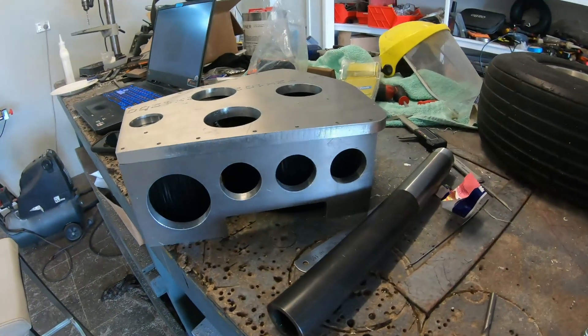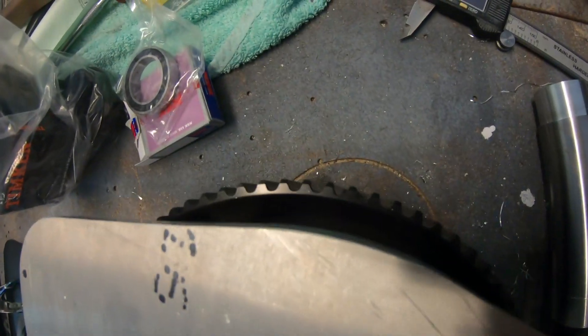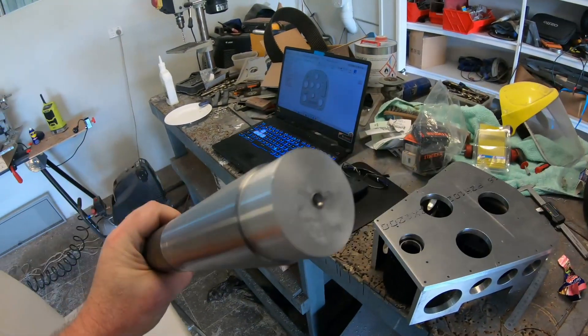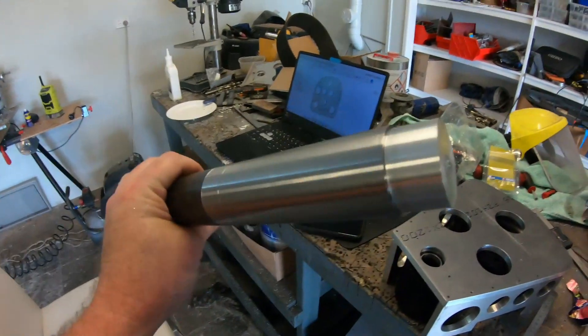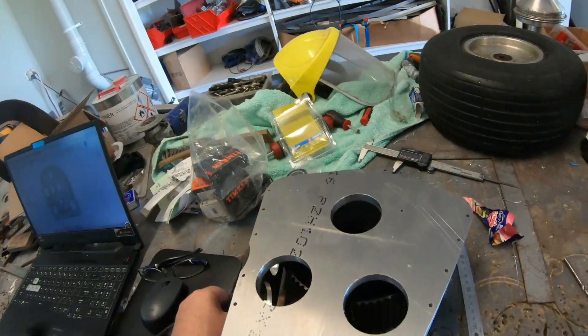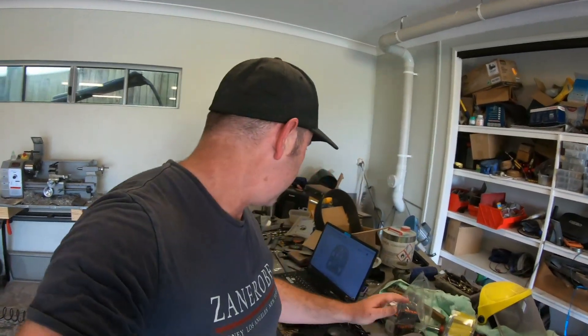It's coming together. You can see I've got the gear pulley sitting in there too — they're not quite lined up, but I've got the shaft working on it at the moment. This is a chrome moly tube — a hollow shaft so you can run an in-flight adjustable prop through it. Pretty straightforward. Nothing really flash about it; we're just machining, machining, more machining.